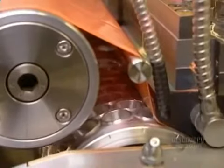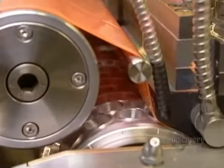The machine presses the gel ribbon into a die with half-circle pockets, each forming one half of a ball shell. The machine does the next three steps in one shot. It aligns the two half shells together to form a hollow ball, injects the fill, then seals the two half shells together.